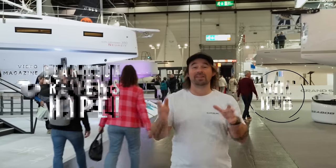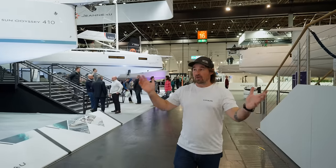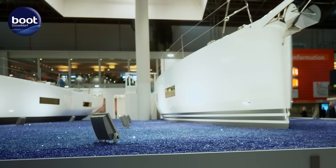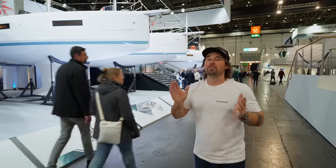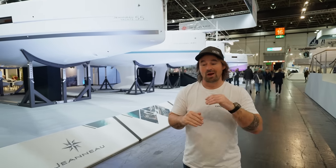This week on Sailhub we're talking about hull insulations and what's going on inside everybody's boats. Most of these boats we found out last year at Boot Düsseldorf are all cored — a foam core that goes inside the laminates, which makes the hull stiffer, lighter, and is also cheaper to build. But some of us don't have cored hulls, cored decks, or any insulation at all. Where would we start?